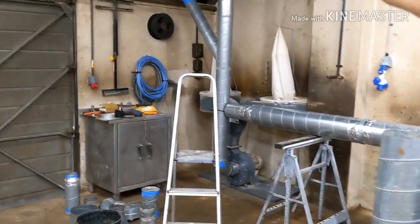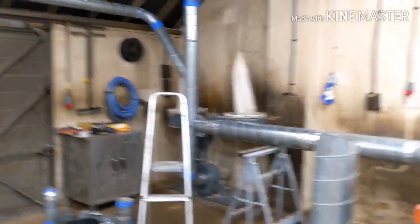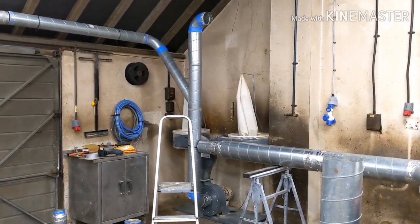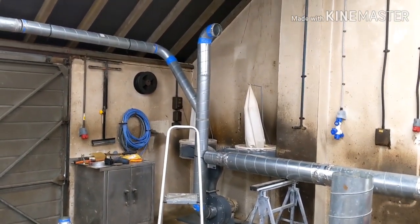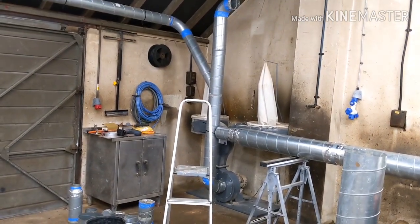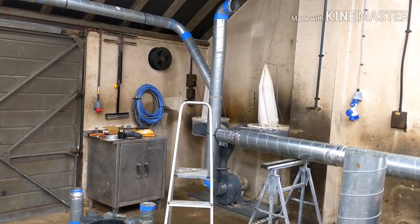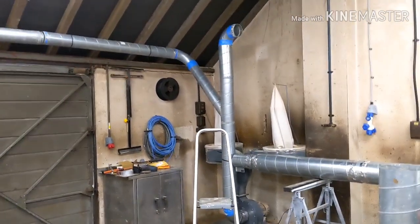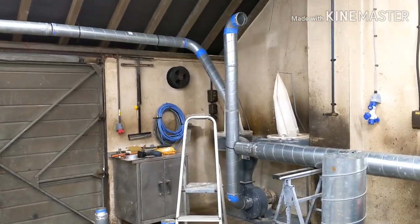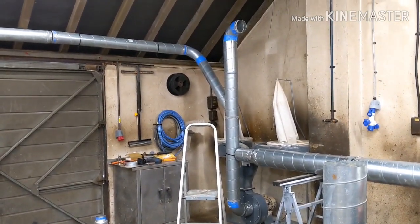They're not because they've been cut, but you can see the odd little bit of blue joints from the old workshop, and some of those were put together with 25mm self tappers, which I've changed for 16mm ones because I use a lot of beech, and anyone who machines up beech regularly knows it goes like a bird's nest. And what I was finding is it was catching up on the 25mm self tappers where they poked through and clogging up regularly.